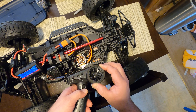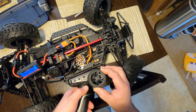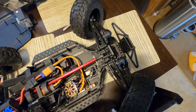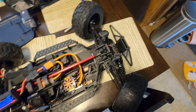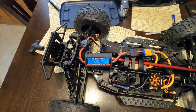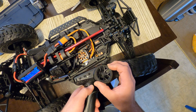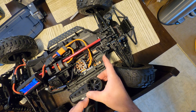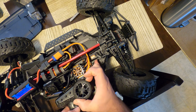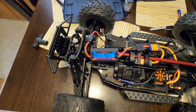I'm going to set the adjustment off just to show you. Going left moves the travel one way, and going right moves it the other way. When I over-travel it, you can see the servo housing and servo mount moving — that's overextended. The tires are still moving but the servo is overextended, and you can tell because I'm drawing nearly one amp just by doing that.